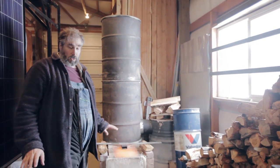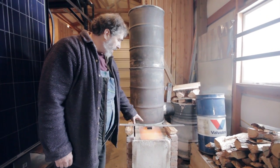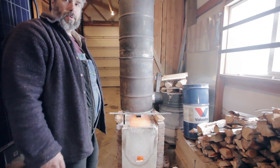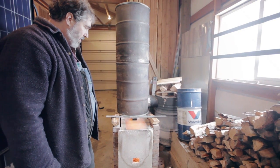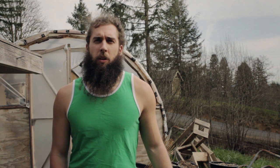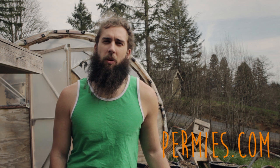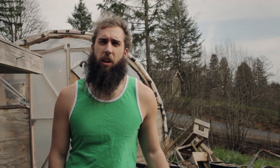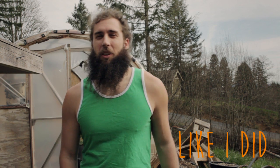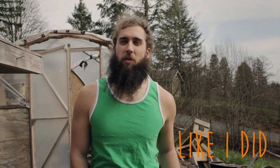I'm standing too close to it — it's way too hot. I think this is borosilicate glass on the top, which is the kind of glass used for wood stoves. This is a temporary thing; we're going to replace that with a proper door eventually, but that's just Duraboard, which is extremely insulative for high temperature scenarios. If you found any of those stoves interesting and you'd like to learn more, head on over to permies.com — that's the forum Paul set up. If you're interested in that Kickstarter, I'll put the link below. Get educated before you build one of these stoves and don't just pull a plan off the internet and invest a few days of your life and possibly hundreds of dollars in materials.